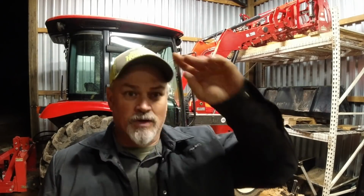But I'm thinking that the fuel pump, and I was talking to my buddy Matt over at WRM Excavation, and I've also been talking to Wes from the channel Watch Wes Work. I think the fuel pump is just not putting out enough fuel. I don't think it's enough fuel pressure, I should say. So I don't know what we're going to do next. I think maybe we could try to bench test the fuel pump. I can't wait to read the comments because I'm sure you guys will have a lot of good ideas for me.